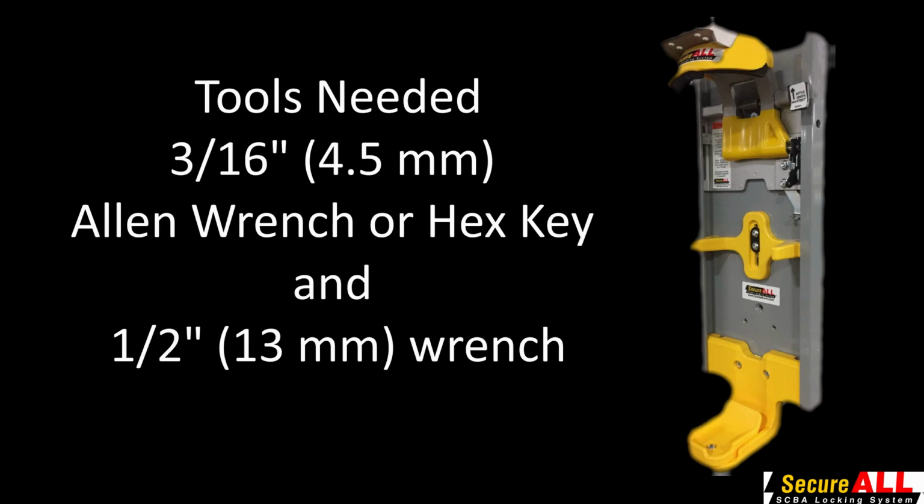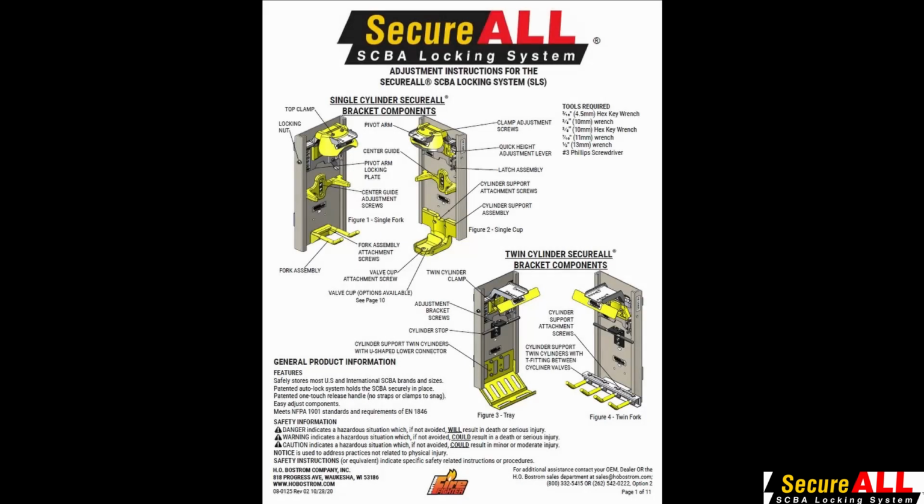The SecureAlls are shipped from our plant assembled. However, adjustments are required to fit your specific brand and model of SCBA. In order to make adjustments to the SCBA bracketry, the following tools will be used: a 3/16 or 4.5 millimeter Allen wrench or hex key, and a 1/2 inch or 13 millimeter wrench. Before you start the adjustment process, we recommend that you reference the user's manual.